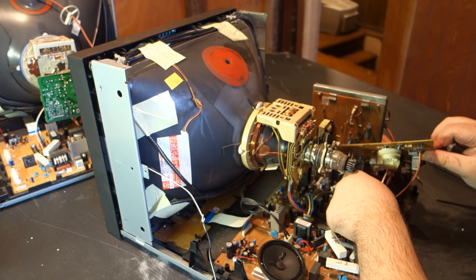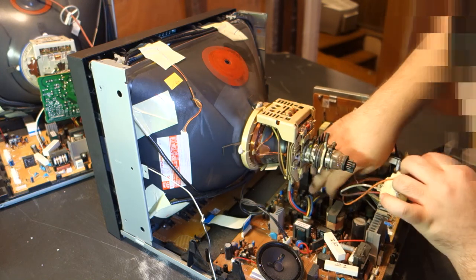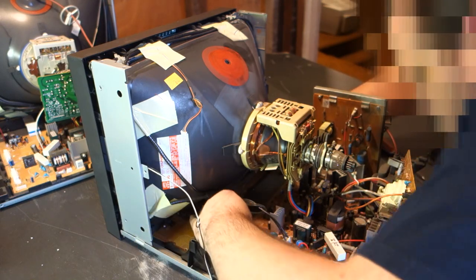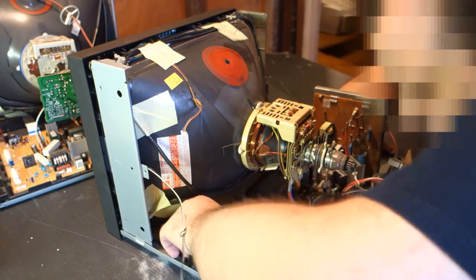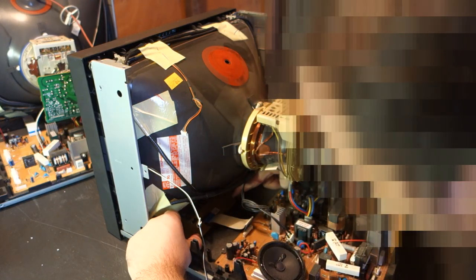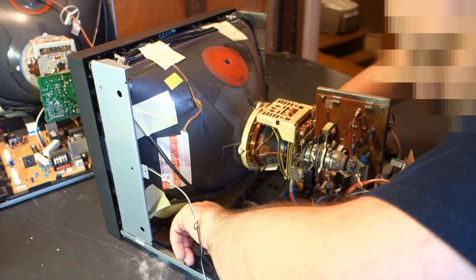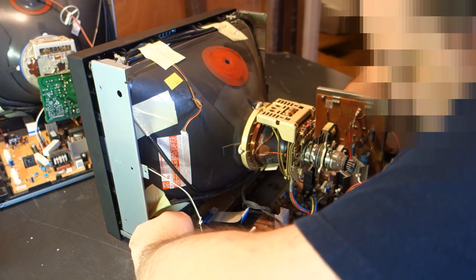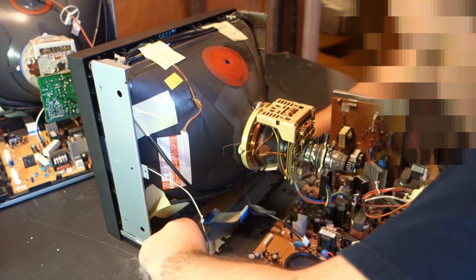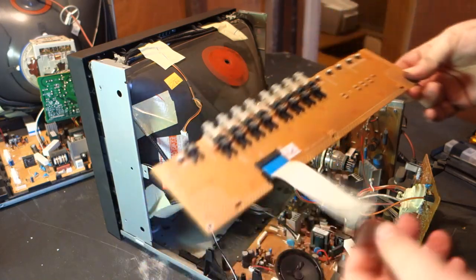I'm also going to leave this bit of fumbling around in so that none of you run into the pitfalls that I did. The metal base on this monitor has a few risers on it for supporting this tray, but they also seem to like to catch and make removing said tray more difficult. Additionally, the buttons on the front PCB repeatedly caught on the degaussing wire. To get said front PCB to release, there are three plastic clips that hold down the board in place. Undo them and push the board forward and it will slide out from a pair of guides.